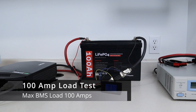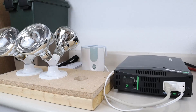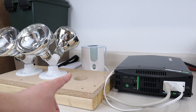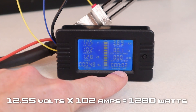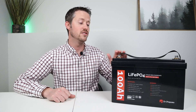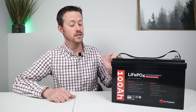It's been about three and a half hours and the battery is fully charged. Now I want to go ahead and test the 100 amp discharge rate — let's see if we can pull 100 amps from this battery without any issues. I have 750 watts of heat lamps and a 450 watt bottle warmer, pulling around 1200 watts or a little bit more through the inverter. We're pulling about 102 amps from the battery and it's been going for two minutes. We hit 10 minutes — very impressive. We've been pulling 100 to 106 amps the entire time. Pretty impressive results for such a budget battery — available at $365, and we confirmed 100 amp hours capacity, 100 amp discharge, and 50 amp charge all worked fine.